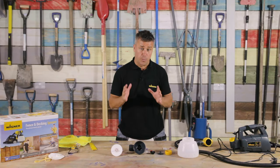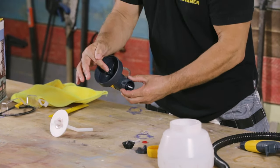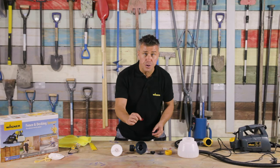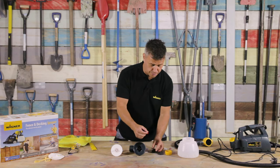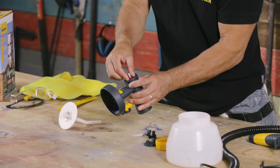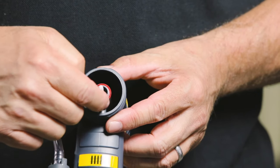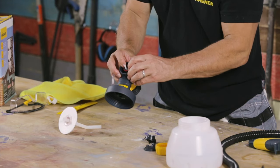Now you've finished spraying the warm water through, take it all apart to dry it off and double check that you do not have any paint left in any of the working parts. You might find the nozzle seal inside the nozzle — take it out making sure there's no paint around it. When you put it back on, place it to the front end of the nozzle and slide it down. When you look very closely you'll see it has a little groove that must always be pointing to the front of the unit.